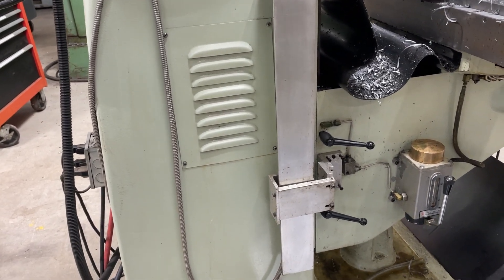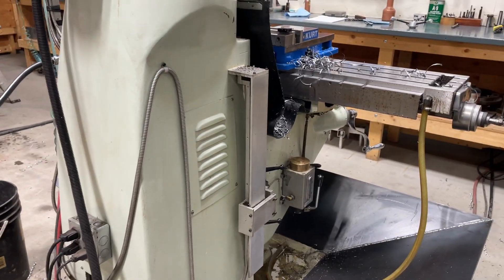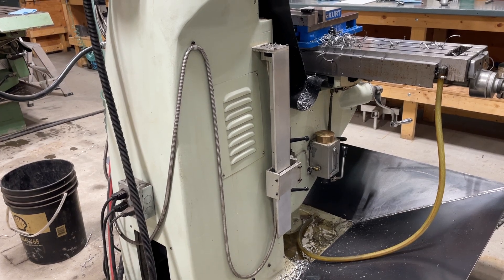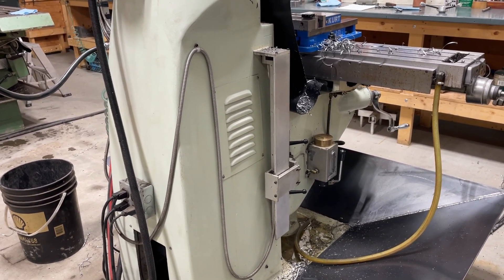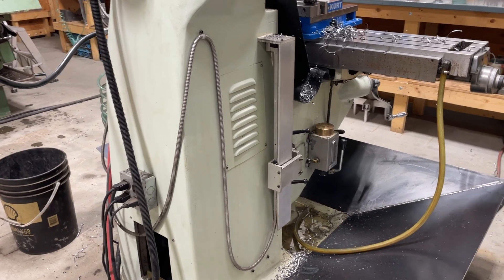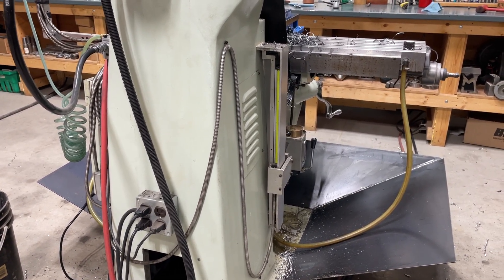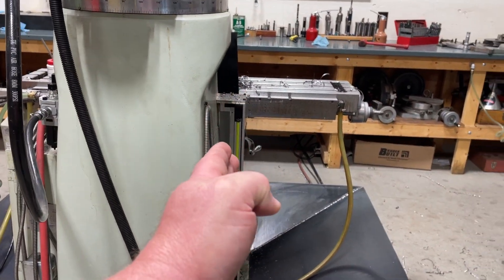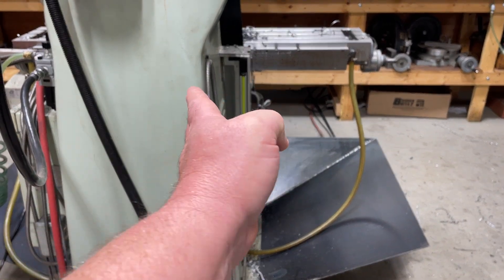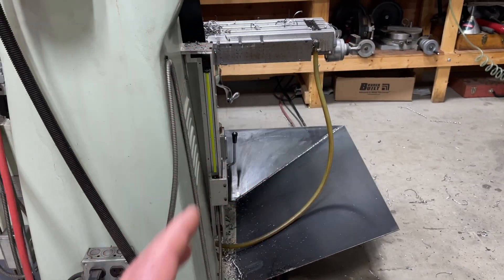Almost 22 years with no problems. The place I worked was changing scales every two years with them unguarded and the head facing the table. Essentially what you need to do is make the scales parallel to the table travel in two planes. When mounting on a tapered or rough casting, the easiest way is to make a bar and use jacking screws and a bolt — that gives you all the adjustment you need. You have to make sure the bar isn't tilted in either plane, and the jacking screws and bolts take care of both.